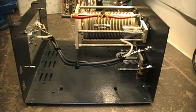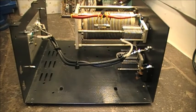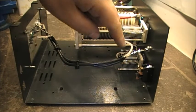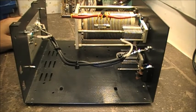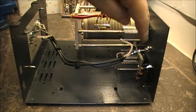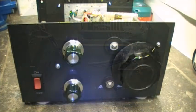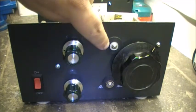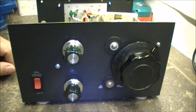This is the left hand side of the tuning box. You have a tuning capacitor here and another tuning capacitor below it. I'm using 12 gauge wire here, but also RG58 coax going between the two antenna connectors and the variable capacitors. The coax is grounded to the chassis. The roller inductor is insulated from the chassis of the box using rubber spacers and ceramic and plastic insulating material — basically whatever I could find to insulate.